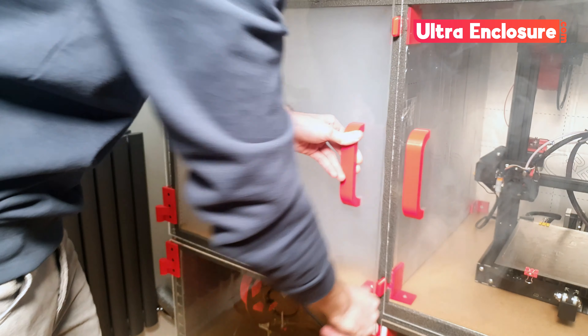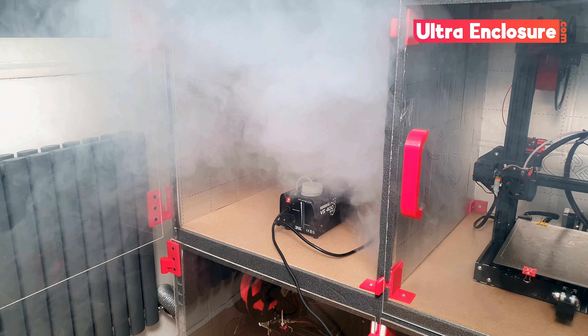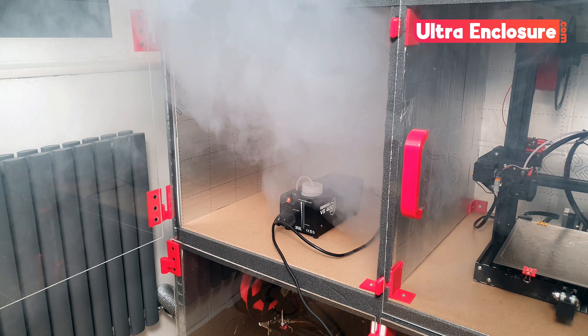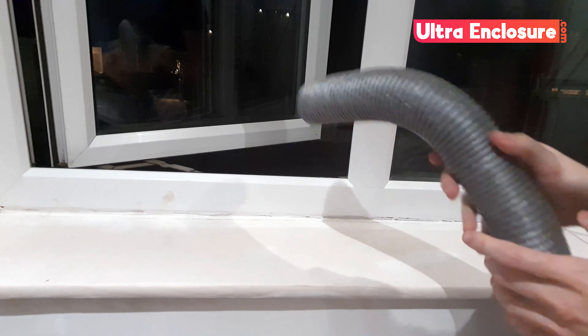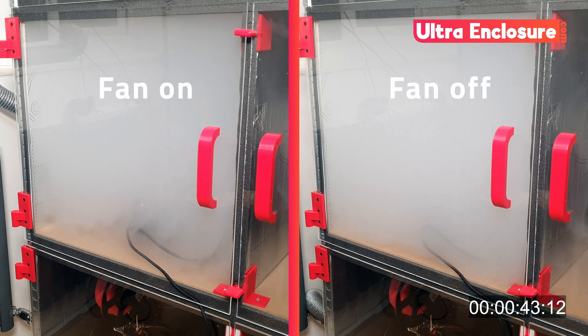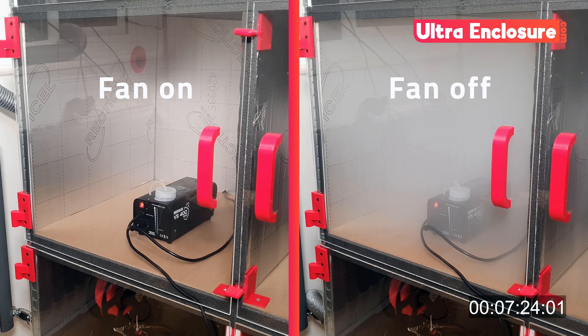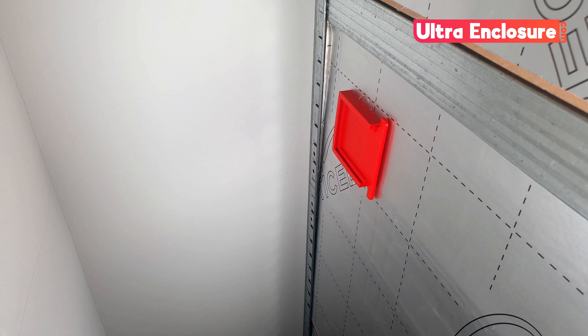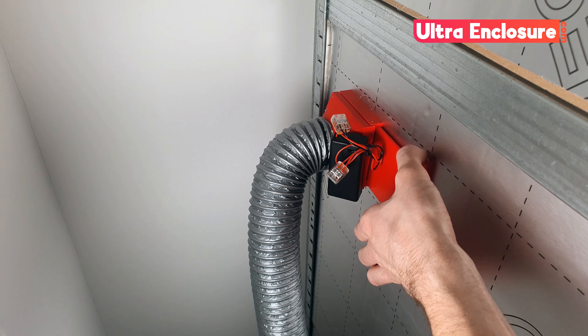However, as you can imagine, this creates a new problem. If you store up all of the gases from a long print and then stick your head inside, you're hardly improving the situation. So for the final test I'm going to attach and turn on the extractor fan, drop the hose out of the window and trigger the same 15 second burst. As you can see here side by side, with the fan on the smoke has almost entirely gone within 5 minutes. Meanwhile without the fan, after more than 10 minutes, there is clearly still smoke inside the chamber. Based on these results, you could run your print with the enclosure sealed up, and once it's complete, attach the fan for 5 to 10 minutes before opening it for the best results.